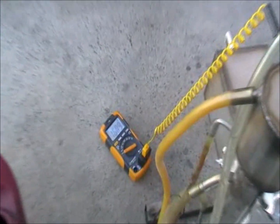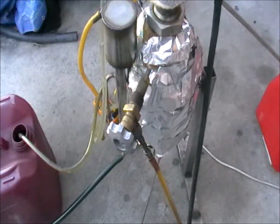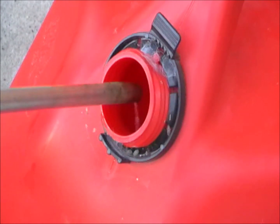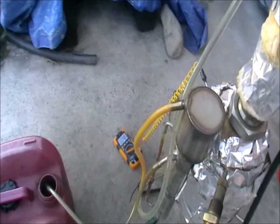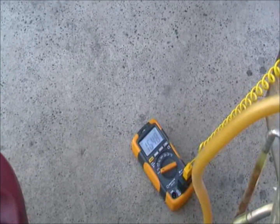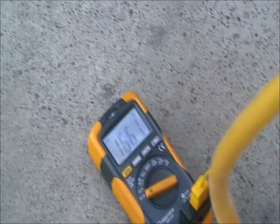You have to observe your thermometer temperature only to make sure that the temperature is not climbing up — that's the fine control of the oil supply. Now you can see the increase in production here. At the same time the temperature has stopped at 164. This is the very light oil I'm processing today, just for demonstration purposes. Temperature stopped at 164, maybe 168 — a slight fluctuation of about 5 degrees up and down is not really a concern. It's at 165.6; it can drop a little but it's stabilizing.